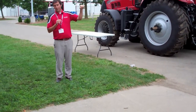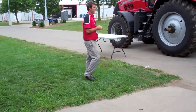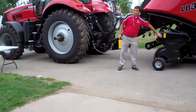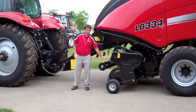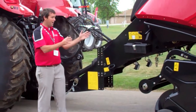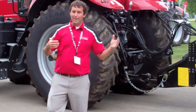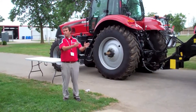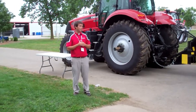But, we can make that plunger go faster, but the key is we got to be able to pick that up faster. And the way we accomplish picking that material up and getting in there quicker is with our totally new pickup design. It's got a roller wind guard standard as an integral part of the baler. Another thing is a feed assist roller as well, forcing that material from the sides into the pre-chamber. So instead of relying on gravity to get that in there, we're really picking that material up, but really putting a direct channel where it needs to go to improve the capacity, improve the efficiency of the feeding.